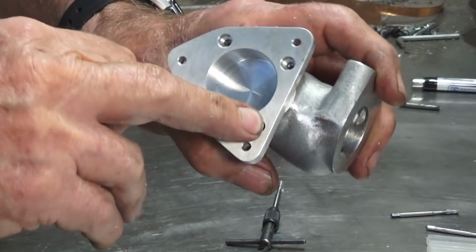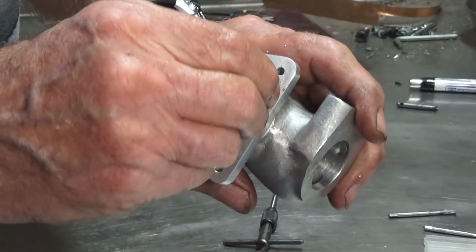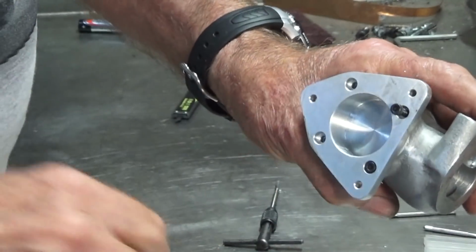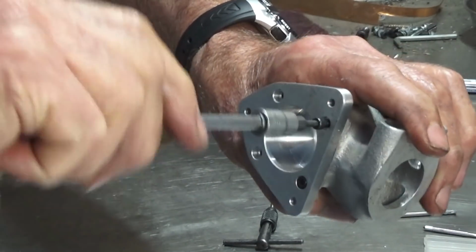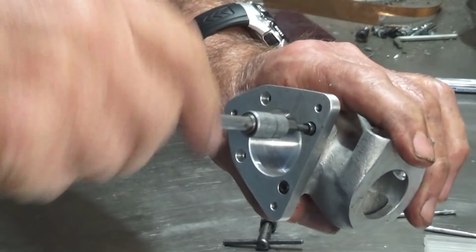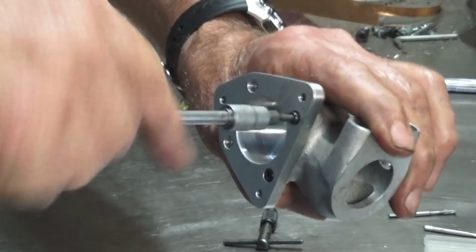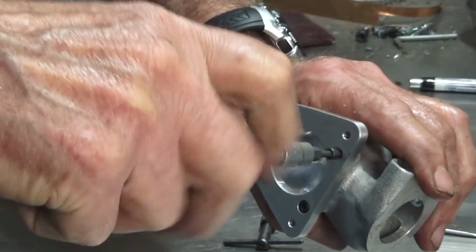Well, I got one screw fitted in there. Unfortunately, these socket head screws are just a fraction too long, possibly because I can't get the tap to bottom right out. It won't cut threads all the way to the bottom of the hole. It's just physically not possible. So this one here, when it drives home, it's still got about 1.5 millimeters to go. So I'm going to shorten the screws, and I'll show you the time-honoured method for shortening screws.